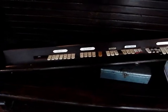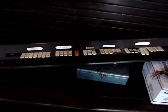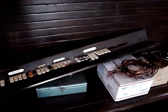And I'll also put a spare cable in there to cover the direct electric magnets for the future pipe organ version of this organ. It's going to be a virtual organ, of course. And my 25 pair cable that I'll wire in will start with number 13 here and work to the right, because the first 12 wires will be the pistons, the 12 pistons. So that's how I'm going to wire it up.